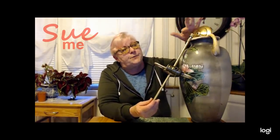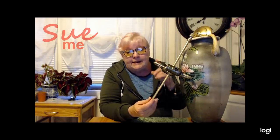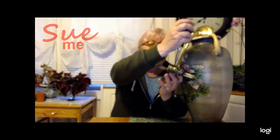Hopefully we'll get into the shade repair at some point in the future, but for today we're dealing with the lamp. This is how I got it. This part of the lamp — there's a fitting in here — and it was sheared right off. So the first thing we have to do is take this lamp apart and check the cord. Because whenever you have a situation where you have raw metal edges, that could have cut into the cord, and that's dangerous. That could actually start a house fire. So we have to deal with that first and foremost.